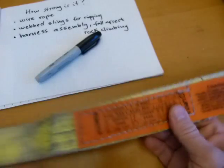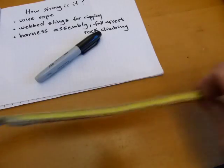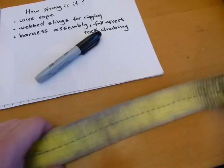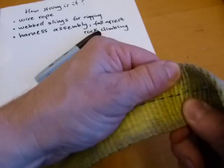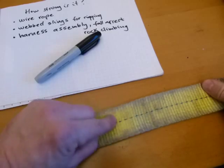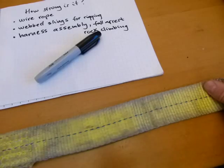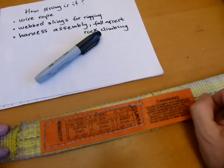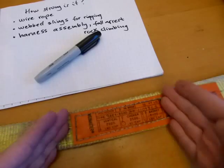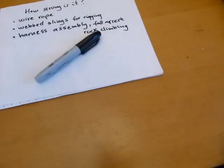That's what the tag tells you. However, this tag only applies if the stitching is intact, if it's not oily or greasy, not torn, and doesn't have embedded concrete or other impurities that will abrade and cut the polyester or nylon fibers. This tag is only applicable when the sling is new and maintained in impeccable working condition. If it isn't — tragic story.